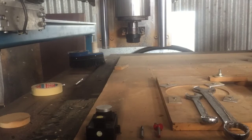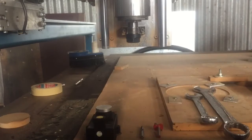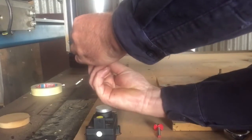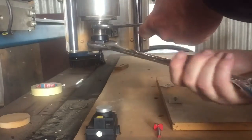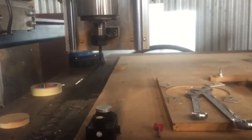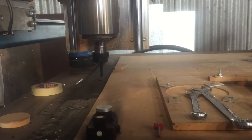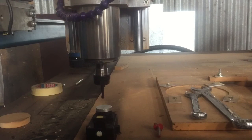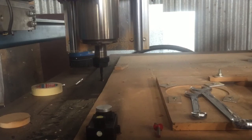Okay so we're ready to roll with the program now. You can see there's no tool in the spindle nose. I'll hit cycle start and the machine will move to the change point. It'll wait for me to fit a tool, then hit cycle start again. The tool is driven down to the touch probe to do a tool set, then it will retract off and start the program.